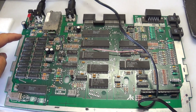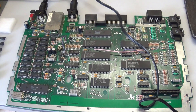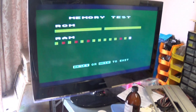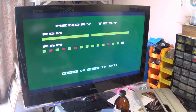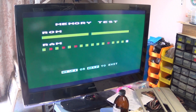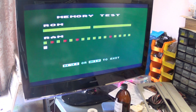Okay, so I piggybacked the first chip in the top there — it made no difference to the actual pattern on the memory test. So I moved that chip and piggybacked the second one, and straight away I can see on the screen some of the red blocks have disappeared. So it has made an improvement. So now I know that second chip definitely has an issue. I'll leave that one piggybacked and move on to the next.